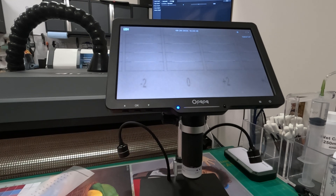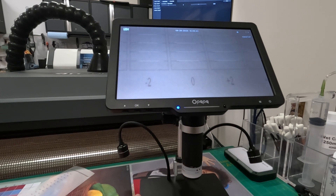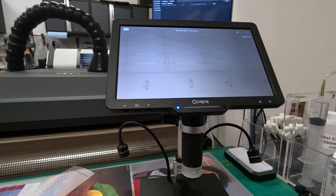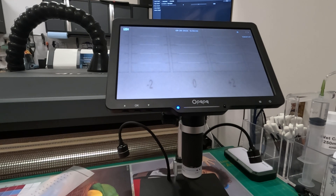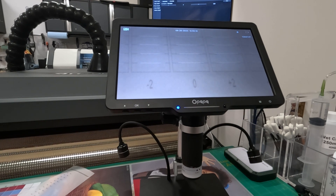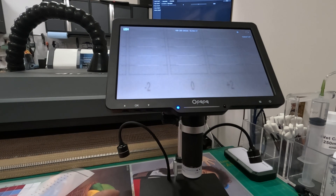Sometimes you end up going back and forth. I can almost guarantee that if I printed these again without any adjustments they would be perfect on zero — because when I printed my test print this morning everything was spot on. I don't know why, but with this printer I can print the alignment check once and it looks off, then print it again without changes and it's perfectly on zero. So you might want to do two prints before making changes — it might already be in alignment.